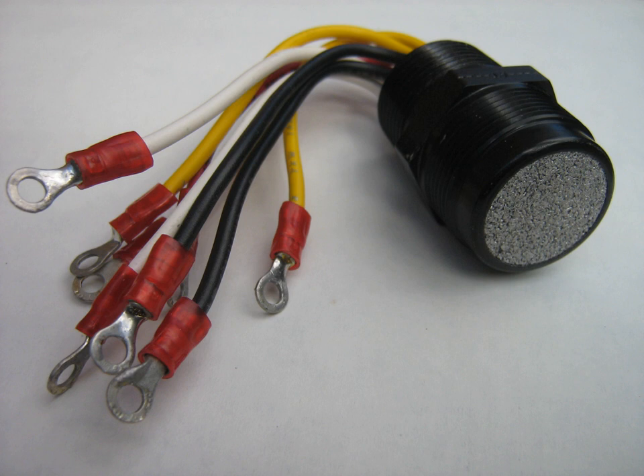Current is passed through the coils so that they reach a temperature at which oxidation of a gas readily occurs at the catalysed bead. Passing combustible gas raises the temperature further, which increases the resistance of the platinum coil in the catalysed bead, leading to an imbalance of the bridge.